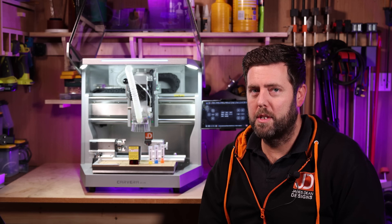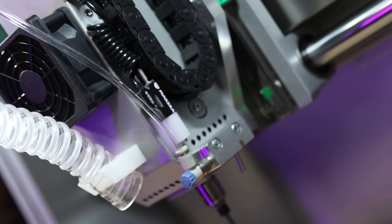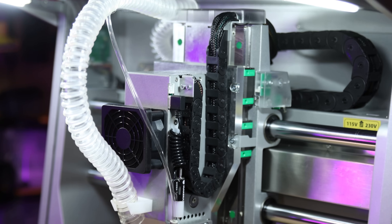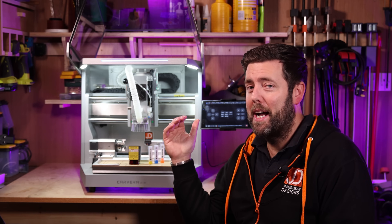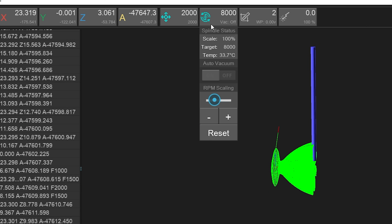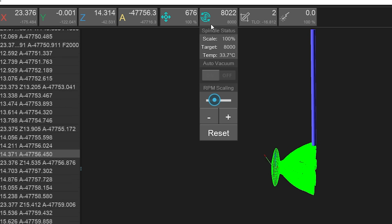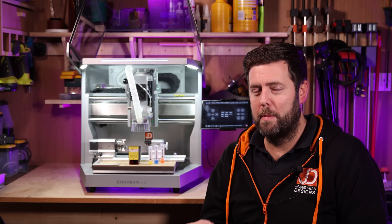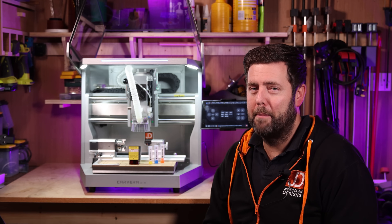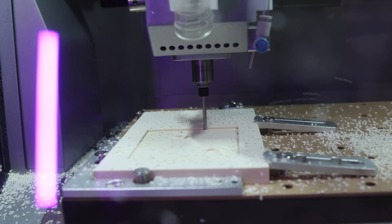One negative comment I saw was about this only having a 200-watt spindle, and I completely understand — on the surface that doesn't sound like a lot of power. But again, the value is in the detail. This is a closed loop spindle, or servo spindle, which feeds back to your control board. The benefit is it can supply enough power to ensure it is hitting the correct RPM and actively track it as well. If it is set to 10,000 RPM and hits a denser piece of wood that would normally bog a spindle down, it can feed in more power to guarantee it stays at that 10,000 RPM. Your results are going to be much cleaner because it maintains a much more consistent RPM and doesn't get bogged down.